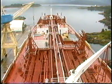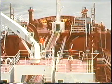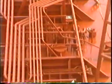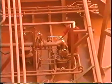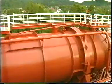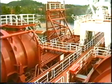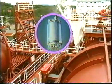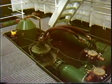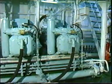The ship is a 29,999 tons of deadweight chemical oil product tanker, fitted with 39 FRAMO stainless steel hydraulic-driven submerged cargo pumps, type SD-150, two submerged pumps, type SD-100 for deck tanks, one FRAMO portable cargo pump, two FRAMO ballast pumps, as well as bilge pumps and fuel oil transfer pumps, all driven from a centralized FRAMO-designed hydraulic system.